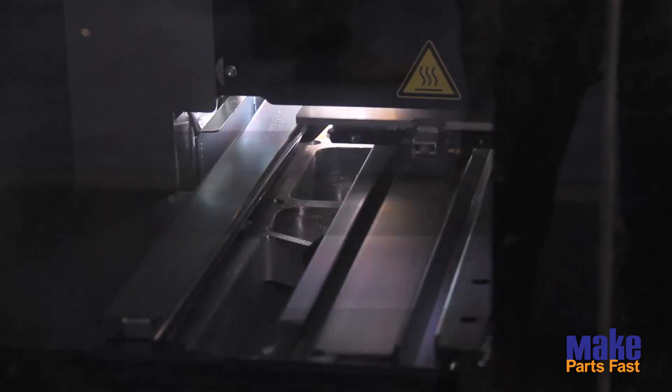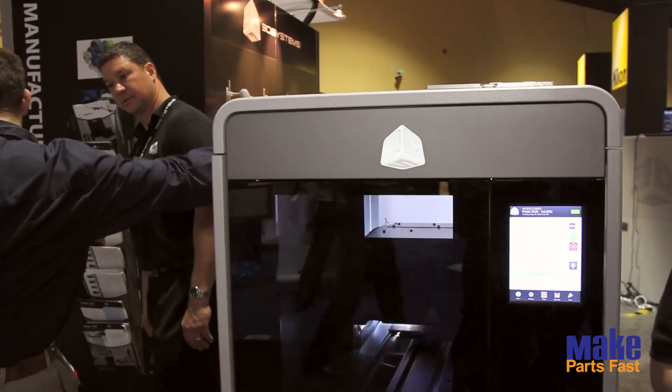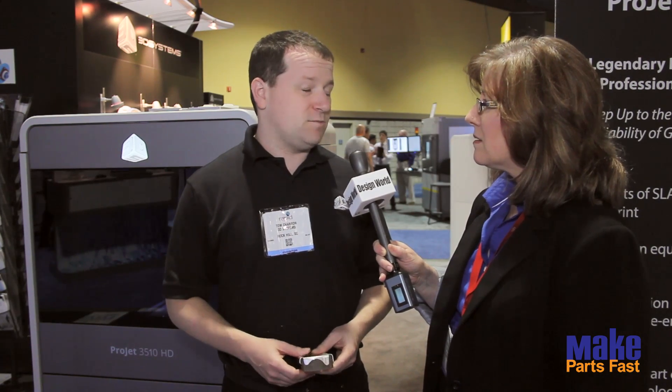Real big stuff requires injecting at pressures that plastic molds can't hold up to. But for smaller things running at 10 tons of pressure, it's not a problem at all. Really any kind of thermoplastic is able to be run — the same pellet plastic you'd run in any injection molding application — up to about 675 degrees is what we've seen customers running. Almost all common injection molding materials run below that 675.